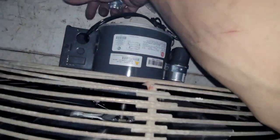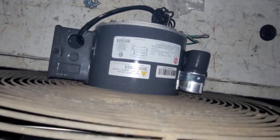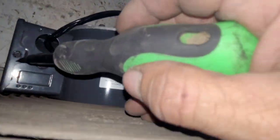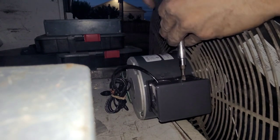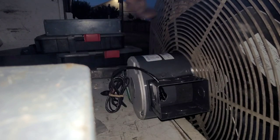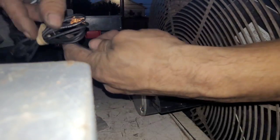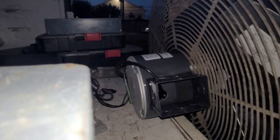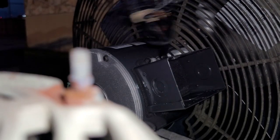One last thing I want to do — because this motor comes from the factory like this, I'm going to go ahead and put a Romex connector seal just to help keep moisture or anything out of it. To do that, I'm going to remove this right there. So Romex connector goes on pretty simply — you've got to run the whole thing through the wire.